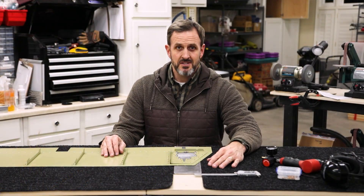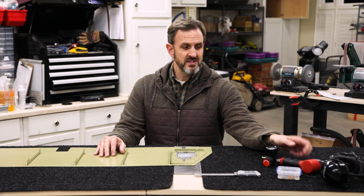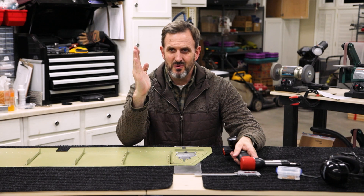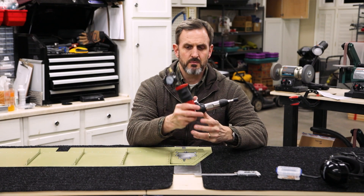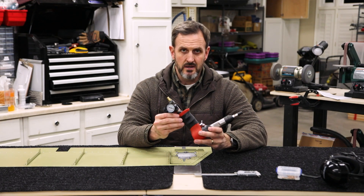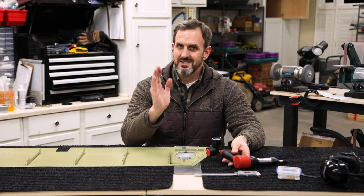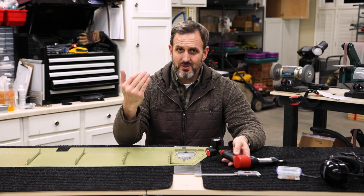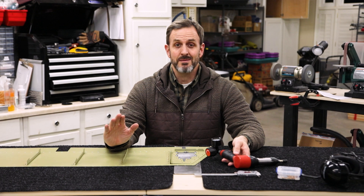I'm about to start back riveting. I haven't done this on any of my actual airplane parts but I have practiced quite a bit. Every time I would hit the shop head with the rivet gun, the rivet tail would lean and there was nothing I could do about it. After searching the forums, rather than having an airflow restrictor on the rivet gun I tried putting a mini air regulator, and I found that when I dial it to about 30 psi for the 3/32 rivets, it doesn't lean anymore. I can do very consistent rivets very quickly.